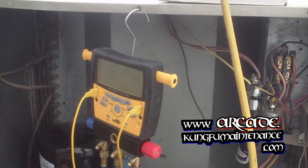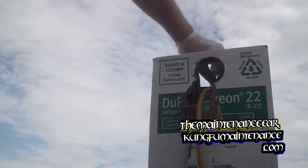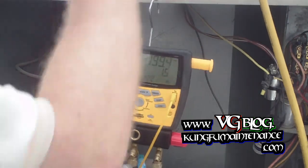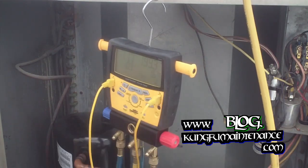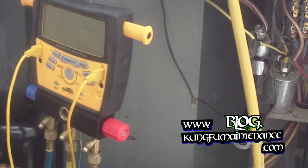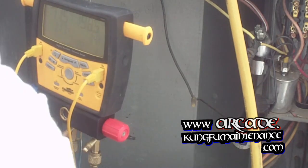Now let me show you what we do with the high side refrigerant. What we do up top is turn off our refrigerant. We can either leave the hose hooked up to our can or hook it up onto the port — either way so it's got a seal on it. On the high side you want to wear gloves, and these are quick connects. You always want to use quick connects when using refrigerant — it cuts off the flow at the hose right away, makes it faster, and helps prevent frostbite.